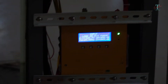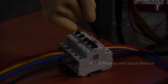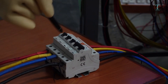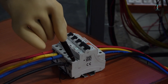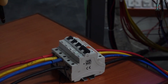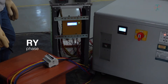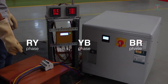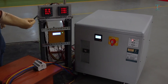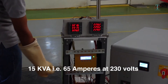We will now see the working of our HAPS voltage regulator. Here we have provided the input RYB phases and input neutral connection to the demo unit through single-pole circuit breakers. This will enable us to break any one phase or break the neutral for demonstration purposes. We will observe that the unit shall continue to work even when one phase becomes unhealthy. So we will now run the unit on RY, YB, and BR phases one by one. Output of the unit is loaded at full 15 kVA, that is 65 amperes at 230 volts.